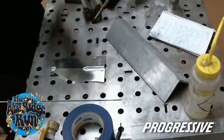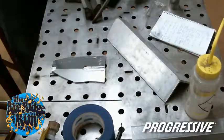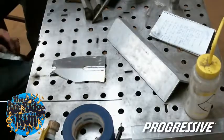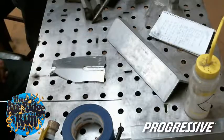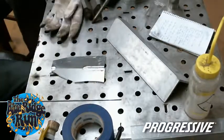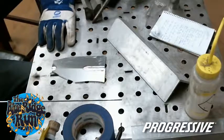to avoid potentially not getting full penetration or a good fill in what you're trying to weld, especially if it's old pieces you're trying to fix, or something that has had contaminants and oil in it and stuff like that, and you're trying to clean them up and make them look good. When it comes time and you've prepped it best you can, that's one extra way to fix it. And a good technique for the cleaning effect: you kind of ramp up to your amperage and watch the cleaning effect grow, and it'll swirl.